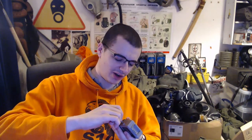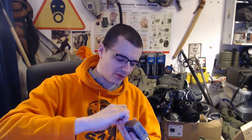If anybody in the US wants a good radiation meter and can get one of these and power them — apparently in some US surplus stores these used to be around 30 dollars — they're actually a really nice range and I don't see them breaking easily because they use a closed little ionization chamber inside. The nice thing about ionization chambers compared to Geigers is they don't need very much voltage at all. You can run a basic ionization chamber off a nine-volt battery without any step-up circuitry, whereas Geiger-Müller tubes need like 300 to 600 volts.